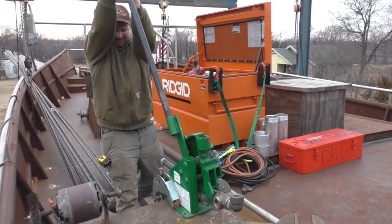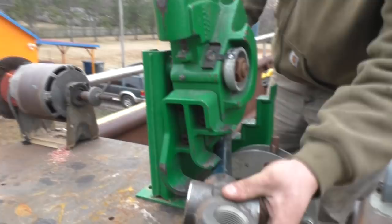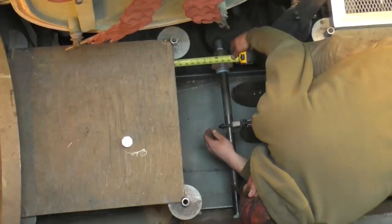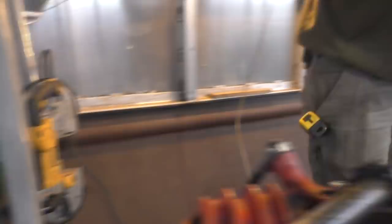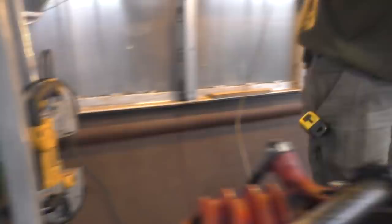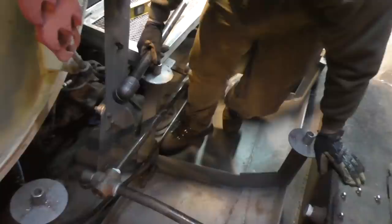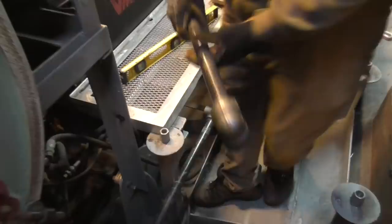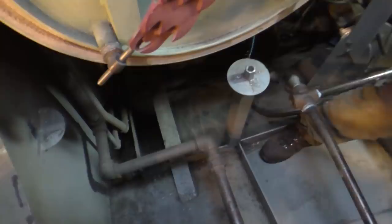It's bending that - amazing by hand. That's not your normal one inch pipe - that's one inch schedule 80, so it's got a heavy wall on it. Brand new 14 teeth per inch blade in that. The trick is being able to cut it nice and straight. Welcome to boats - nothing being square is screwing with me. You just measure across and see. We got that, but it's hitting the brace, so we gotta take it apart and shorten that one.